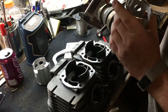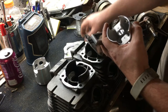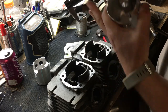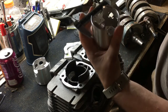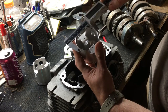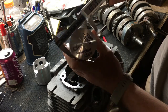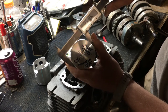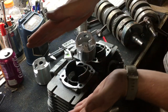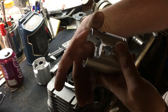The clearance is going to be one and a half thousandths. We're going to use a micrometer, but for speed I'll use calipers first. Measuring the skirt we get 2.555. Going to the top I'll show you the difference — we get 2.5468 inches. This piston is shaped like a wedge, the head being more narrow. As the piston expands, the skirt is thin and will expand first, but not much because there's not much mass there.